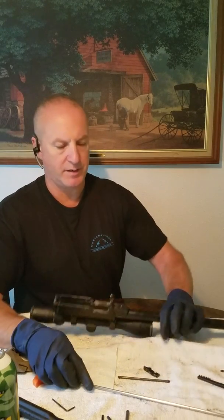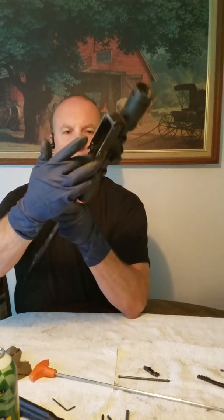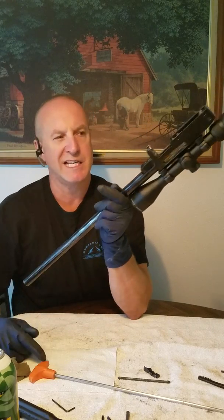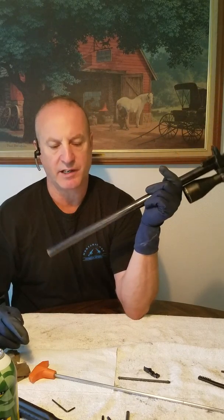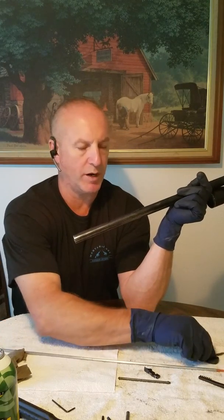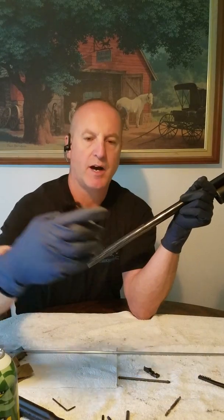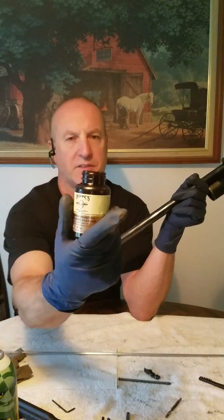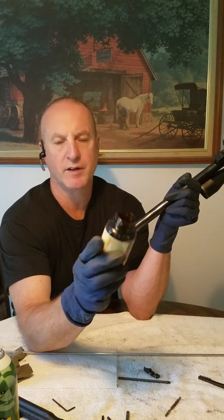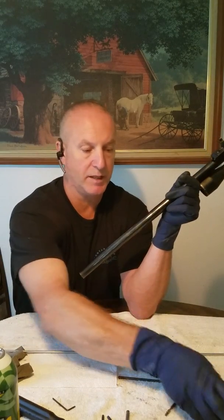And then what I do is, before I clean inside here in the chamber area and the receiver housing, everything, clean that last because it's going to get dirty. So at this time, I'd put a wire brush like this on the rod, obviously, and I like using this Hoppe's No. 9. This Hoppe's No. 9, I buy the one that says copper remover bore gun cleaner. And everything has copper in it, or jacketed, so not everything, but a lot of stuff is copper.